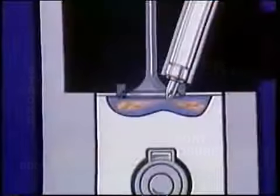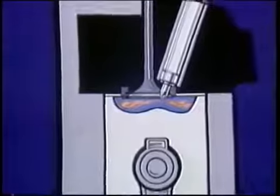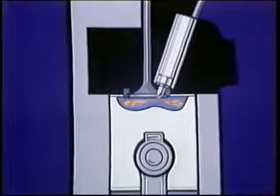On a graph, you can see this same idea, how the plunger lifts in its stroke from BDC to port closure, shown in orange, and then begins delivery of pressurized fuel through the delivery valve. As you know, fuel is injected into the cylinder for compression ignition. When you understand pressurizing the fuel, you'll understand the first job of the pump.